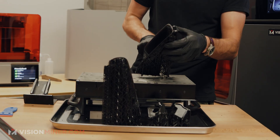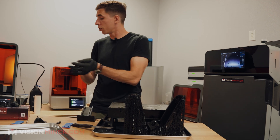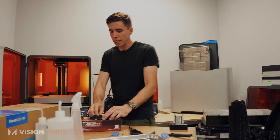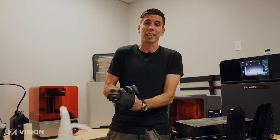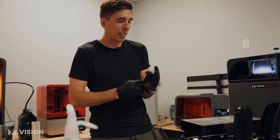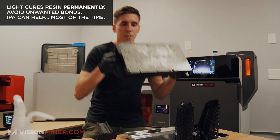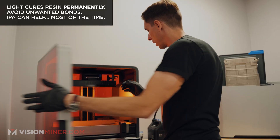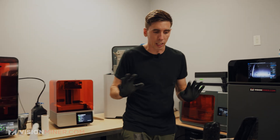Watch out for explosive parts. I'll show you what these are in a second, but I actually left the door open. I'm going to change my gloves before I touch the machine so I don't cross-contaminate everything — you get resin everywhere. Remember, resin cures with light, so if I touch something and it gets light on it, that resin will be permanently affixed. But it does rinse off pretty well with isopropyl alcohol most of the time. Get that back in there, and it's ready for another print.